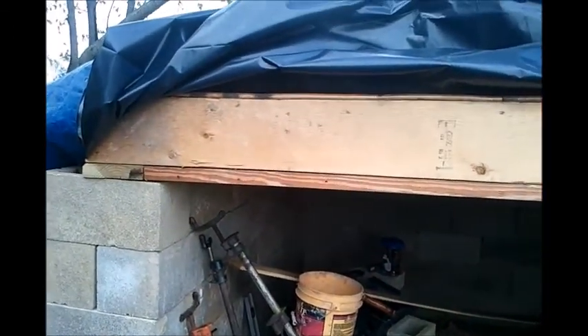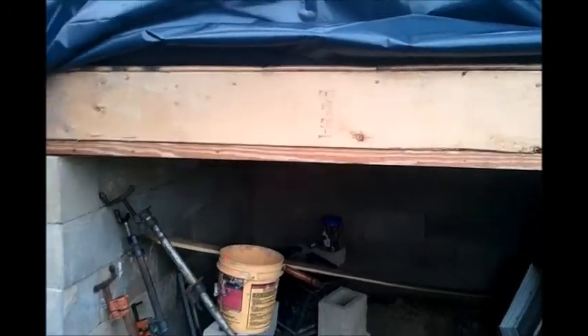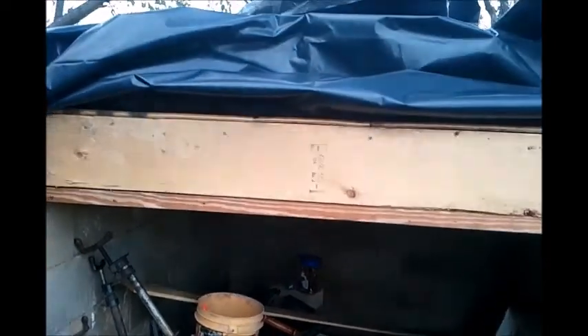He normally does a six-plank style house — a plank, a plank, a plank — all joined together to form one continuous solid piece of wood that's basically an inch and a half thick and arbitrarily wide. This is a pretty small building, only about eight by eight. Mine is going to be stud walls put on top of this deck. I've got two two-by-eights side by side here, and then the two-by-eight joists going that way, with a little bracing in the middle even though it's only eight feet.